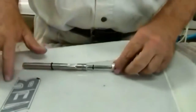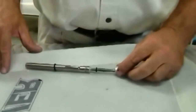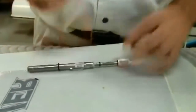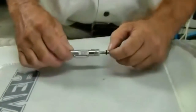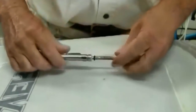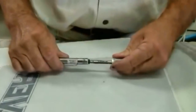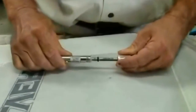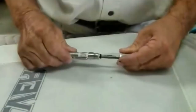The instructions call for stabilized Dacron sails at 10 pounds for the surfaces. We have our O-ring and gauge set to 10 pounds. The way you set it is you push the O-ring forward until it's sitting right at 10 pounds. That's the distance that we're going to stop pushing when doing our test.